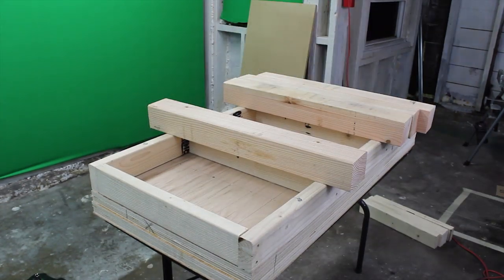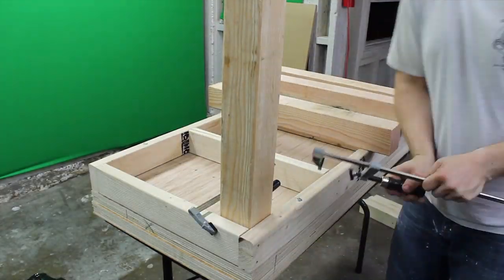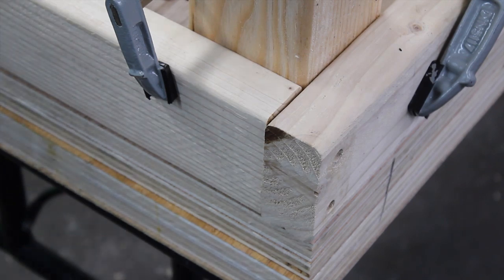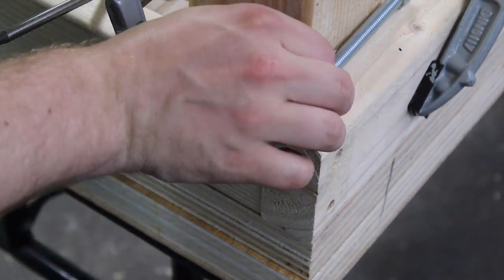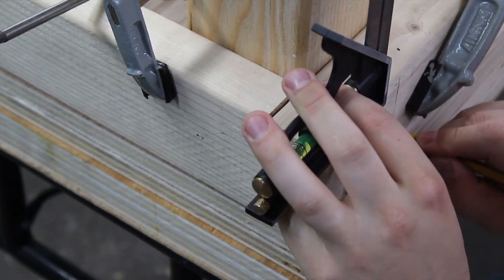At this point we need to get all of our 4x4s together so we can start putting this thing together, at least as far as the bottom frame. Make sure you check each one to find the best cut side, since Home Depot cut them and they may be slightly off — mine were off by about a 16th, but it doesn't matter since I'm using leveling feet anyway. Clamp them all down because we're going to be boring holes for carriage bolts and it's critical that they don't move at all. I decided to use carriage bolts to connect the top to the bottom of the frame — they go all the way through the 2x4 and the 4x4, plus they'll have a washer on the other side. Mark down about one inch from the top and one inch from the bottom so you have about an inch and a half in the middle where they're not going to be hitting — you do not want both carriage bolts hitting each other.